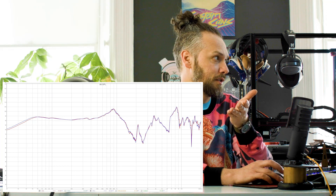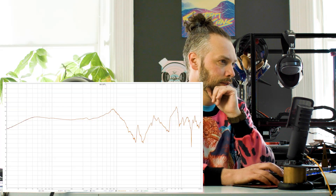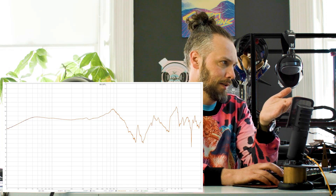Just for completeness and science, I'm going to run another test now to confirm we're still getting consistent measurement-to-measurement results. The temperature is roughly the same today. And yes, that's exactly lining up with the other measurement we took. What I might do is give them an hour to cool down in case the driver got a bit warm after running for 50 hours, and see if that's affected the sound. If the cooled-down measurement perfectly overlaps with the one we took today, then there might really be something in it.